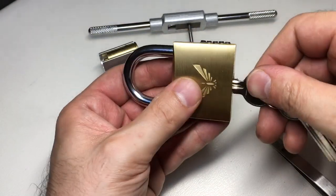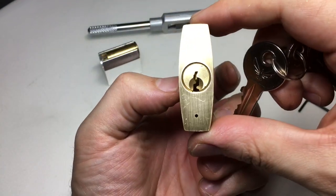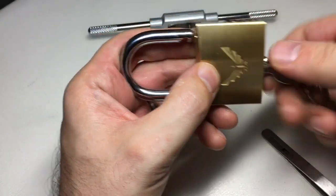Excellent — perfect. Look at that, very neat. Like I said, it's better to leave them out a little bit. As you tighten them up a bit tighter they'll actually tap their way further down into the chambers anyway. So better to leave them out a little bit. And this might work — it does! We've got all the key pins in, you can see them there, and we now have a practice lock.